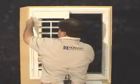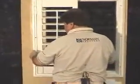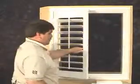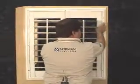Using your hinge pins, install the panel into the hinges. If the pin doesn't go down on the first try, we can open the panel and eventually as it swings around it will go down. Repeat the procedure on the right side — remove the protective cap, place the right panel into the opening onto the hinges and install the hinge pins.